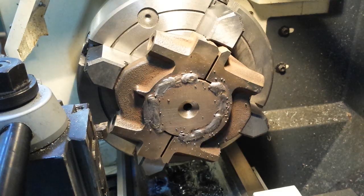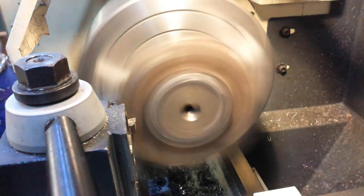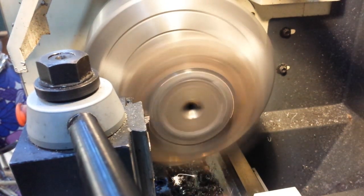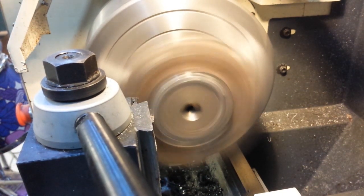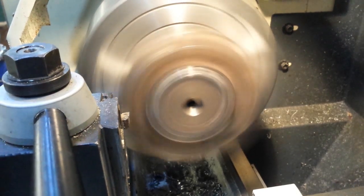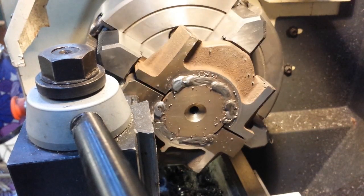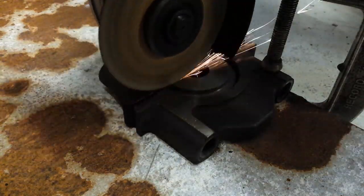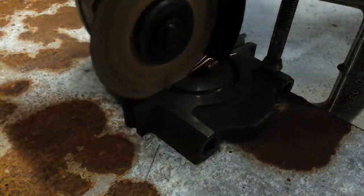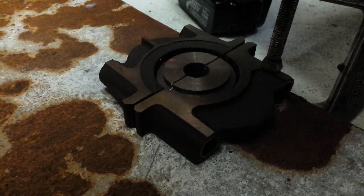I'm pretty happy with that. This should be a little bit interesting — a 0.7mm depth of cut. A lesson here: that seems to have achieved very little and broken the carbide insert. It seems to have massively hardened welding from the cast iron to the mild steel. The lathe is not dealing well. I think we've got to switch to the cordies.